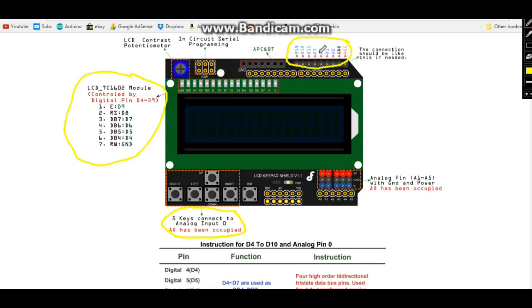The available digital pins are D0, D1, D2, D3, D11, D12, and D13. There is also a separate interface if you want to attach a Bluetooth module, and the ICSP interface. Of course, there's the adjustment potentiometer. Down here are the analog pins still available for us to use as well. So that's pretty nice and very low cost — no problems there.